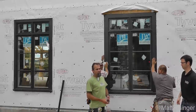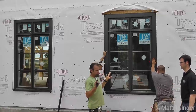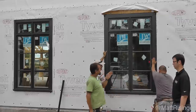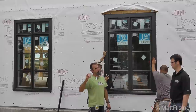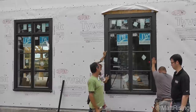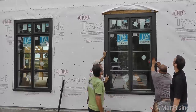We've put our caulking all around three sides — top and both sides, not the sill — we want a means of escape for any water that might get in there. We've laid our window in position. Today, because we have a bunch of windows on the first floor that all need to line up, we ran our laser level from inside. This ensures all of our windows are at one constant level, which really helps at trim stage and on the exterior as well so everything lines up by sight. Our window is set, perfectly plumb and perfectly level, centered in the hole.